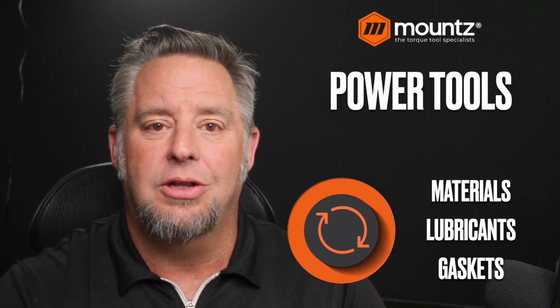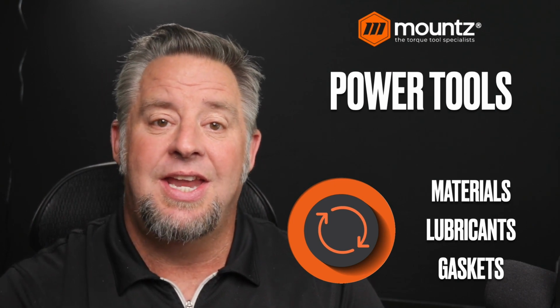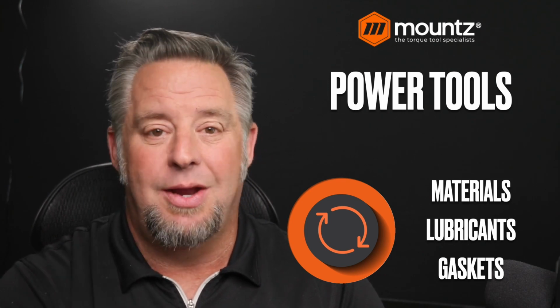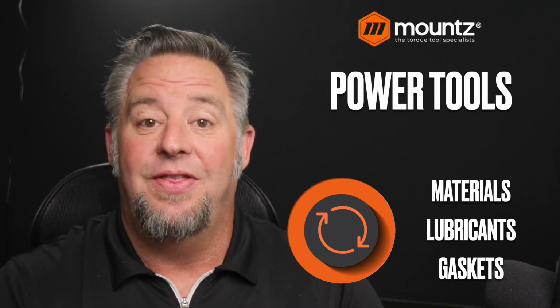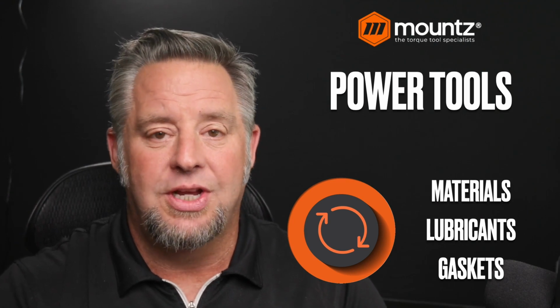Obviously, when we talk about lubrication, if there is an application where a fastener is run down without lubrication, and then we add some lubrication by accident or on purpose, that is going to change the amount of clamp force that tool is generating.